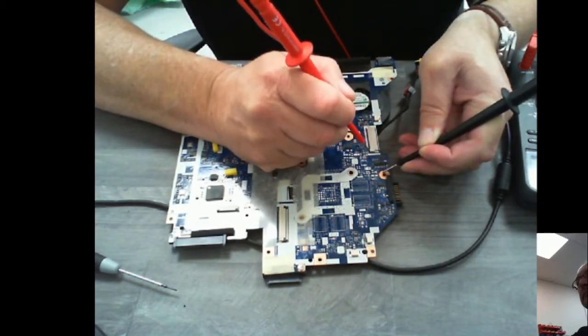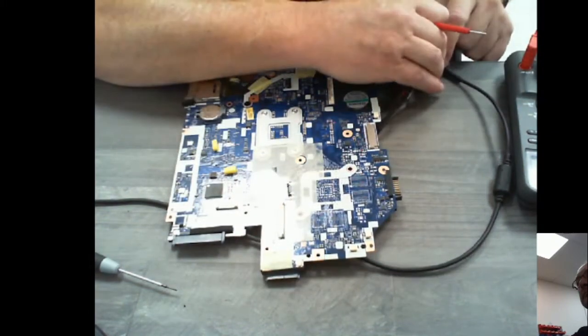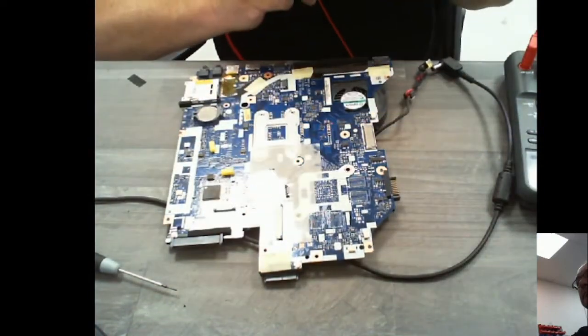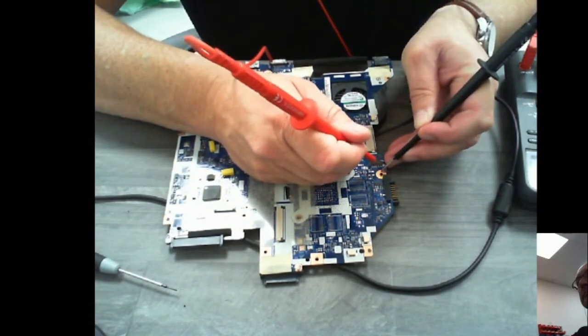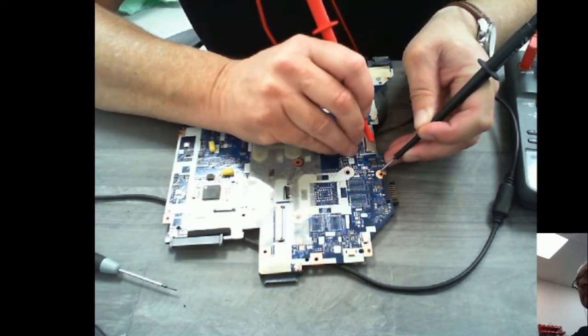The question is, why? Okay, I'm just going to disconnect the power. Let's just come to ohms. Let's just short this out, and let's just make sure that there's nothing going to earth. Now, no, this side isn't going to earth because I've got a voltage there. Or I did have. Okay.